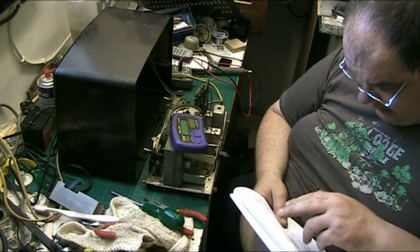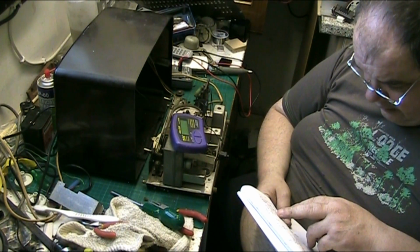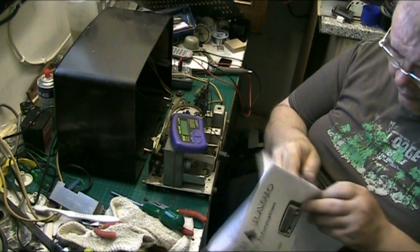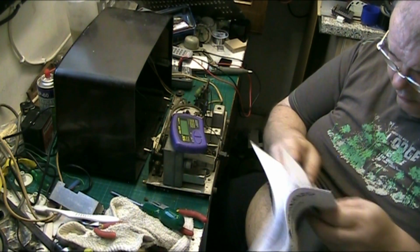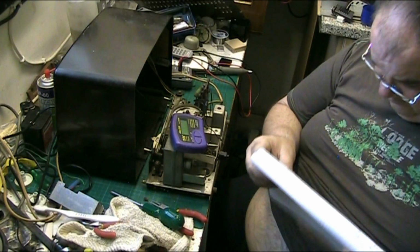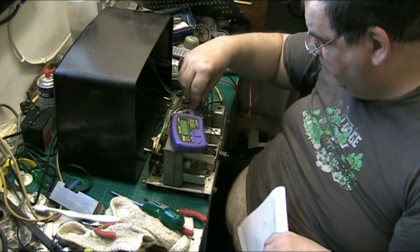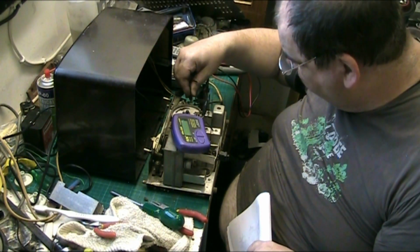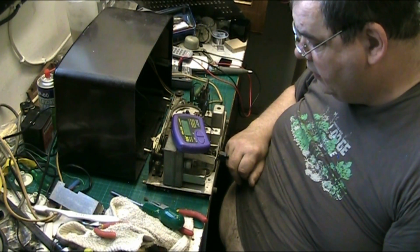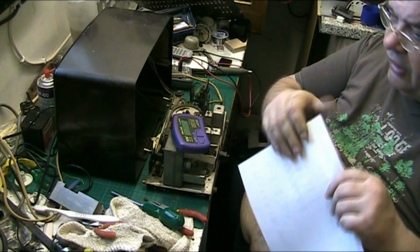Right. Let's see. C48 is 50. And see, what did they say the other one was? C54. C54, and that's 50 as well. So let's just move the tester over to that one and see what it says. Yeah, 56 points, so that's good. That's okay, it's acceptable, it can stay in.